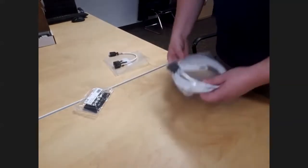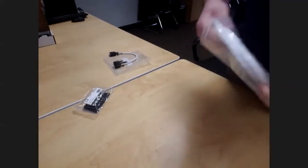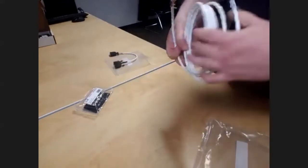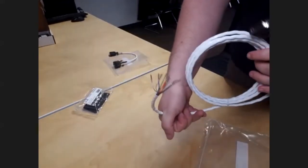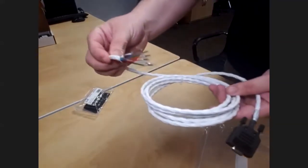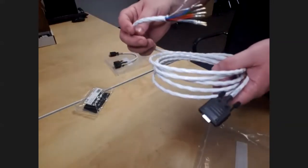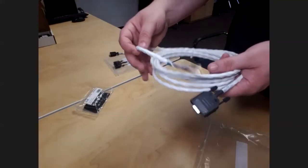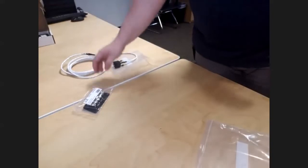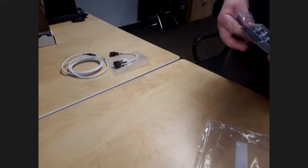Beyond 6 feet, we offer quite long rolls. These are often used for reaching something like a magnetometer. We've tried to be handy for you, and we've offered this with the connector already put onto one end, and the other end comes with the pins crimped to it. That way, again, it's easy to pass through a small space. This diameter that's only maybe 3/8 of an inch or so is a lot easier to run through the wing root or something like that and be able to reach. So we offer an assortment of lengths. Most systems, especially certified systems, require enough components that you'll need some way to split those plugs, because the displays have two each.